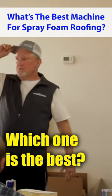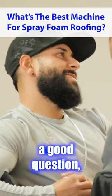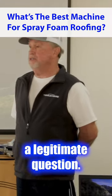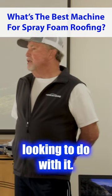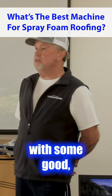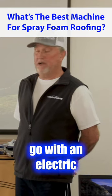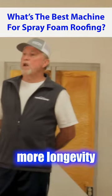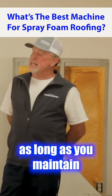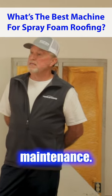That's a good question, actually — a legitimate question. It really depends on what you're looking to do. I assume you're going to be doing roofs, so you want something with good manpower. I would suggest you stick with a hydraulic machine. Don't go with electric or air-driven, and don't go with an air drill. You'll get more longevity out of a hydraulic machine than anything else, as long as you maintain the hydraulic fluid and do the proper maintenance.